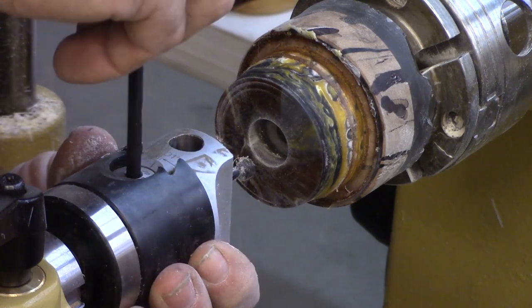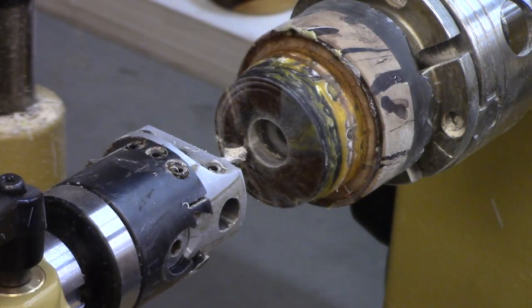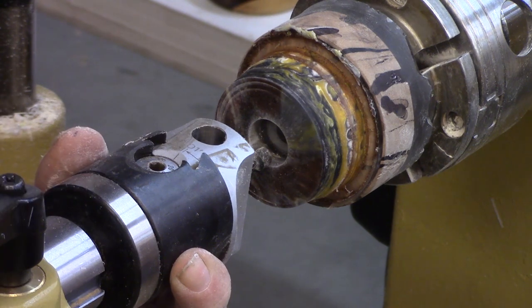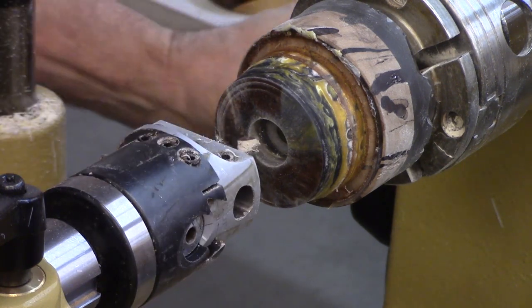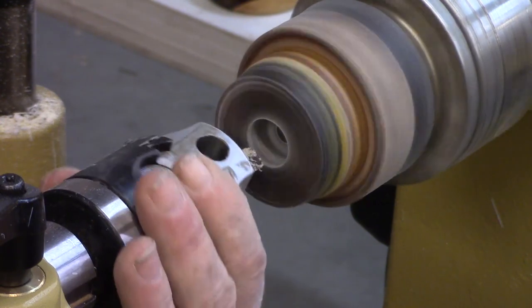The other thing to remember with this tool is the positioning. I've got the cutter in here right now, again, cutting edge up, facing me. Cutting at about 9 o'clock. Exactly, at 9 o'clock. If I rotate this down, that's not going to do anything. It's not going to advance it when I move it here. It will, but it's going to be such a minute amount, it's not going to be that 1/100. You're moving it barely side to side. Watch, we'll do it right here. So here we go, we're taking our cut, right? We're bottomed out. We'll come in here.